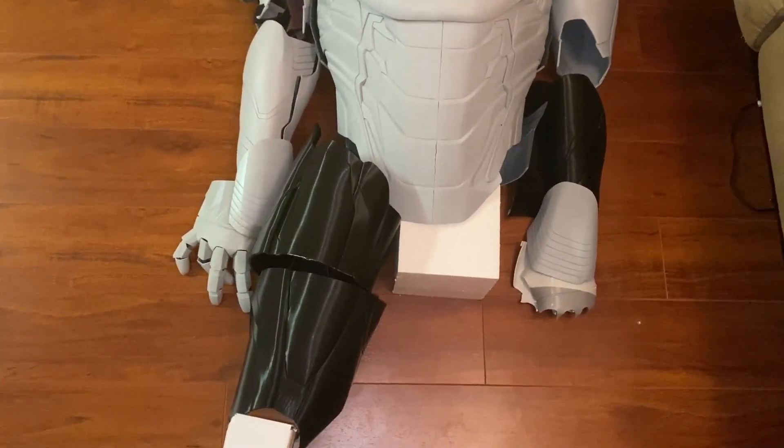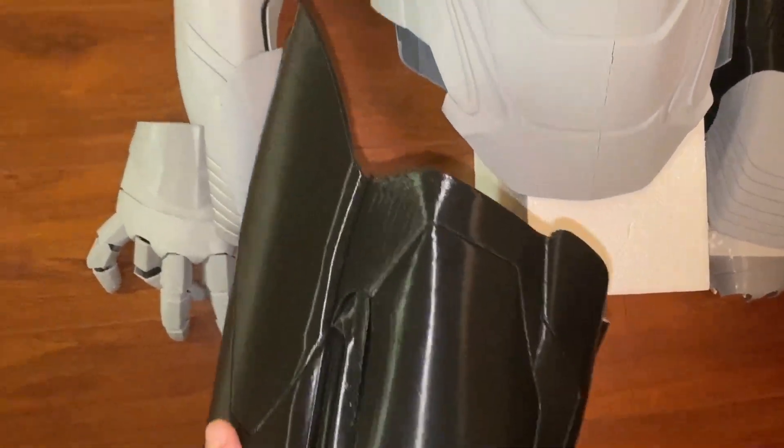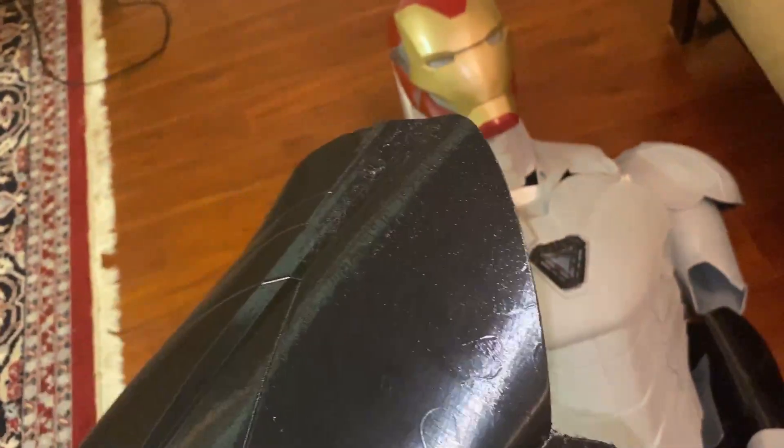That's basically a whole roll of filament, actually might be slightly more. The other thing that was curious to me — I actually ran out of my filament that I normally use about right there. You can see that line, and you guys can see the quality difference. This is all PLA+ black, both brands, but there's a difference of brand — same temperatures, everything — a serious difference. So if you've ever experienced this kind of stuff, I'd be questioning what kind of filament you're using.